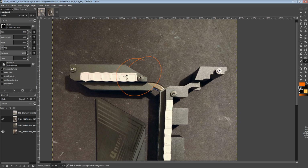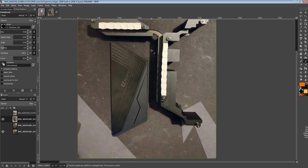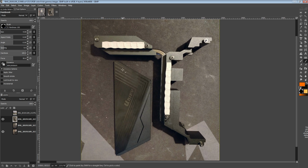So this is the heatsink assembly for this board, and it is an assembly because if you've seen any of the pictures of the motherboard, it looks like the entire I/O cover is just one big heatsink. No, it isn't. There's a separate plate that actually makes up the cover part of the I/O cover. And this is just screwed on with 2 screws. There's no thermal interface material between this and the rest of the VRM heatsink. I don't really think it was necessary.